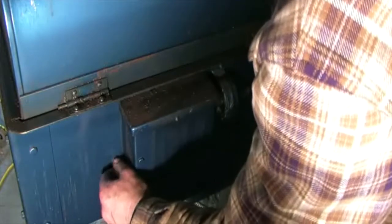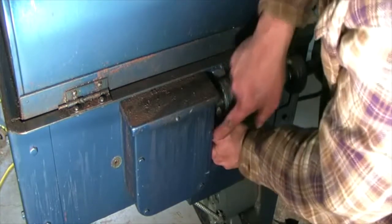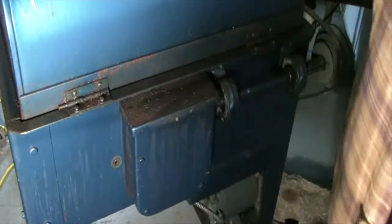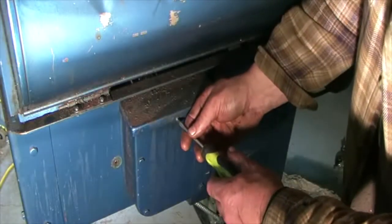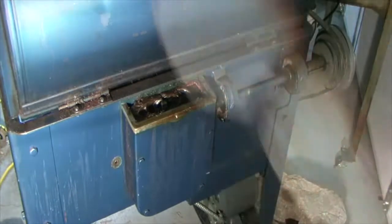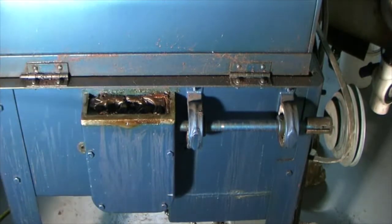All right, we're at the back of the saw. The first bolt, no trouble at all. That comes right out. Fourth bolt, same thing, it's hidden. It's just behind here. That comes out, the washer stayed on. They also have some sealant on there, I'm not sure what it is. I assume there's oil in here, I've never looked. Oh, it is packed full of grease. But I've got two bolts on the other side of that. They got to come out. And that is the smaller 7/16.